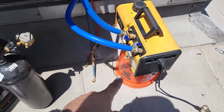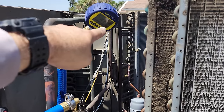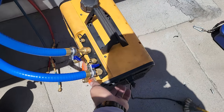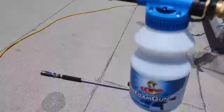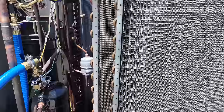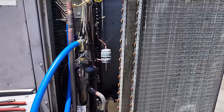We are set up — had to improvise and put the vacuum pump on a bucket because the hose was a little too short. I'm going to start with the suction line closed to see how fast it pulls down on the micron gauge, which isolates the hose from the system. We'll open up the gas ballast and let it run. I've got some of the blue Brightener cleaner from Viper using their gun — this stuff is going to do a good job stripping all the oil out of the bottom of the unit and cleaning the condenser too. I'll apply it, let it sit, and then give it a rinse.